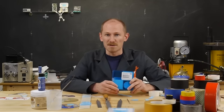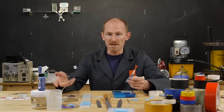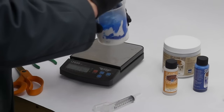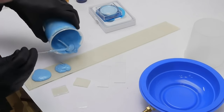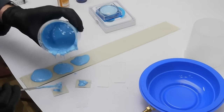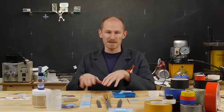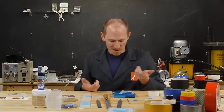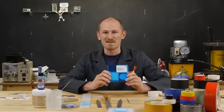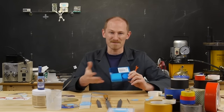The key ingredient is silicone rubber. The idea is that you make gecko tape by casting the silicone rubber - it's pretty easy, you just mix it up kind of like two-part epoxy but with a much greater ratio. You pour it onto a mold that has holes in it to form pillars, then de-mold it to get a forest of pillars. That's the structure we need to make this whole thing work. I'll put links to everything in the description.